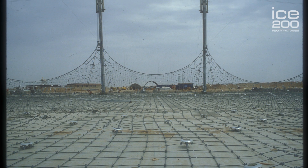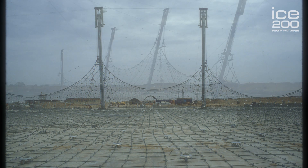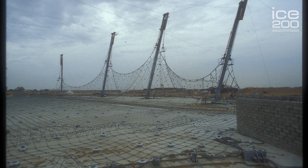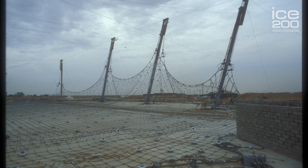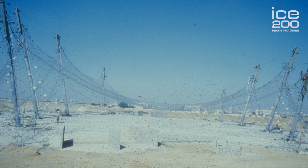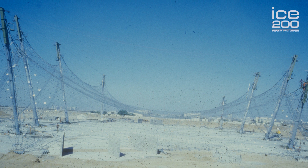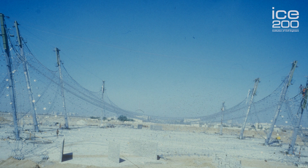Another difficult thing for the engineers was the construction, because you had this huge 80-ton net which you had to drag up into the final shape. The net came in 145-metre-long cables which they then had to put into a 500-millimetre-square net with three millimetres of tolerance, so you have to do really careful work to get that properly all together.